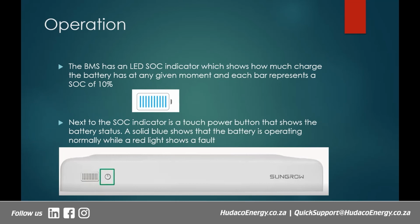There can be a fault with any of the things on your connection. So this is a touch button. It's not a push button. The moment you touch it, it turns on your battery, provided that the switch gear breaker is up. So this doesn't override the switch gear breaker. The breaker must be turned on first, and then the touch control will be used.